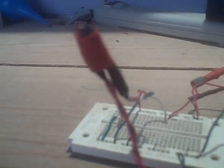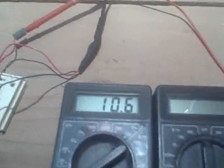As you can see, we have our thermistor bound to the calibrated temperature probe, so their temperature should be approximately the same. First let's take a look at the resistance of the thermistor — that would be this meter here. The resistance is 10.6K.